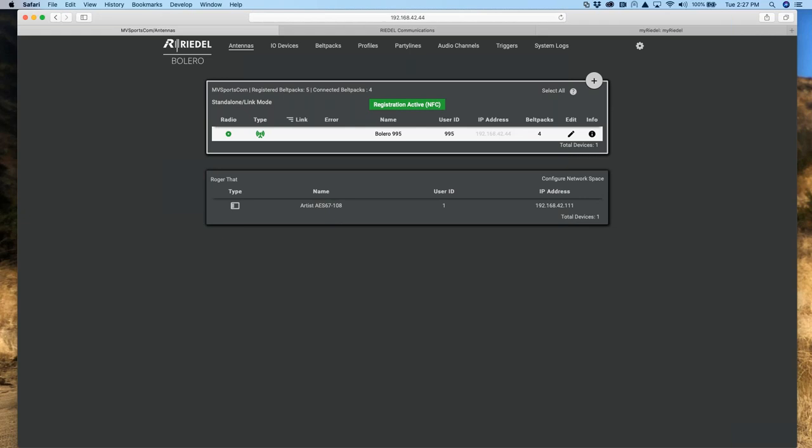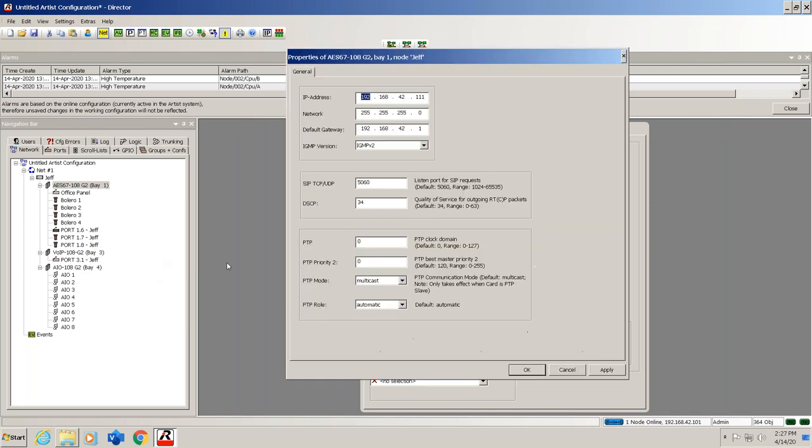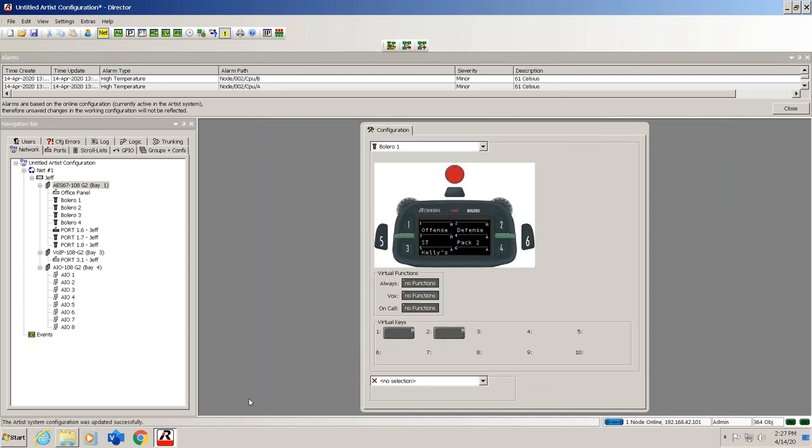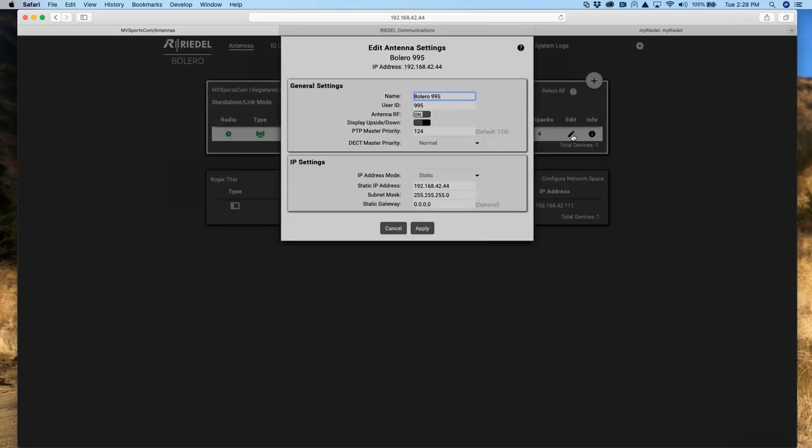And you need precise timing marks on all of those packets to be able to put them back together in the right order. And if your network timing starts to exceed the allowable values because you have too many switches or too much of a load on the system, then you're not going to be able to put those audio packets, those RF packets, back together in the right order, because remember that frequency time division multiple access thing that's happening in the RF domain, that sync is referencing the network PTP sync. So it's sampling the network sync. And if the network sync's not right, then your wireless FTDMA sync isn't going to be right.